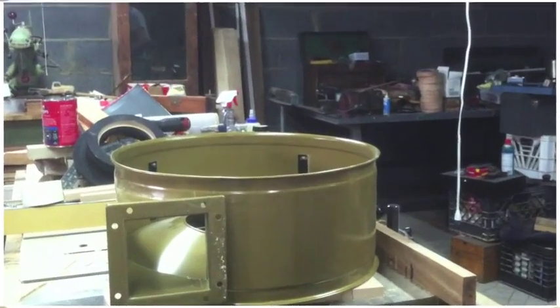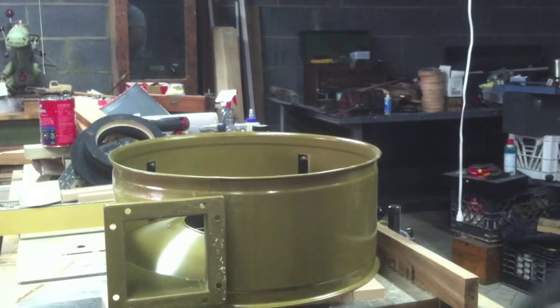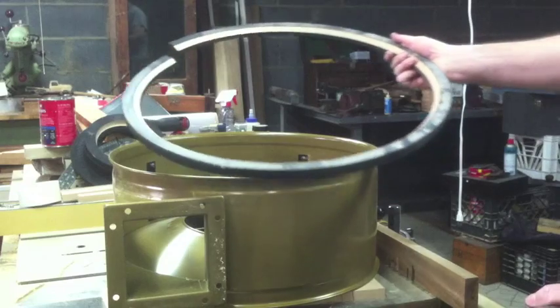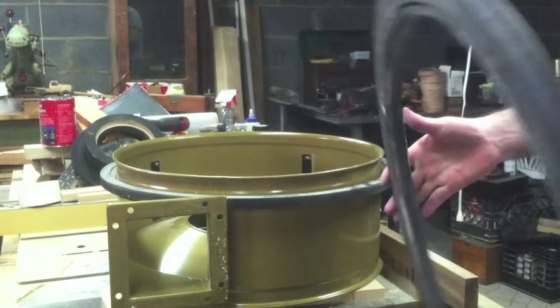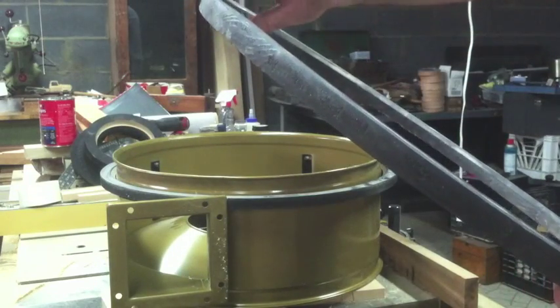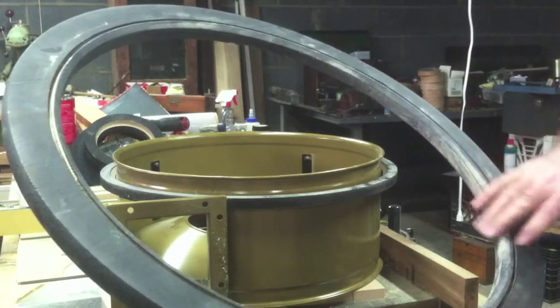In the back it's been flush trimmed so this stove pipe will fit into it, and that will sit down underneath. The stove pipe will go down into it and be epoxied in. I've flipped that over and I'm going to show you the components used to attach this to the baffle. I made a split ring which will enable me to slide this over, and then I have a separate ring — again that 5-quarter pine material — from a 24-inch diameter disc. I've got a groove routed in here and a chamfer to allow everything to slide along a little better.